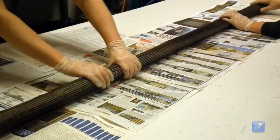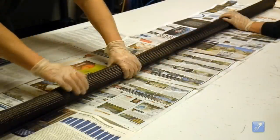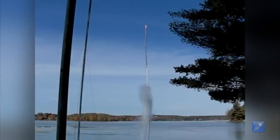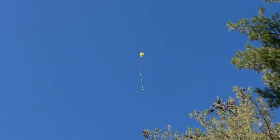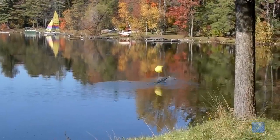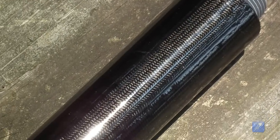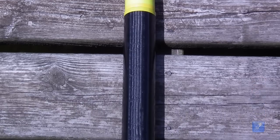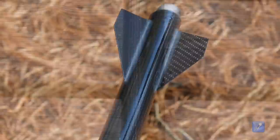The focus of this first video in the series is the pressure vessel, which usually doubles as a fuselage and holds the water and air propellants under high pressure. It must be as light and as strong as possible to maximize the performance of the rocket. There are several ways to fabricate this critical part of the rocket, and you must first decide on the fabrication technique that best suits your application. Of the materials commonly available, composite laminates have the highest strength-to-weight ratio, so this material is the material of choice for high-power water rockets.